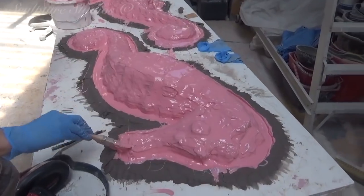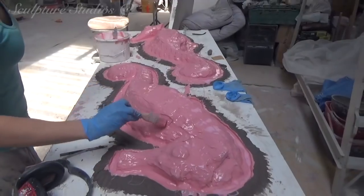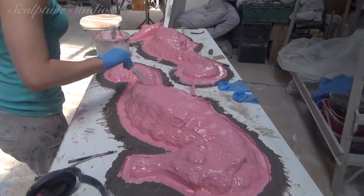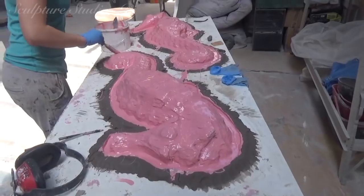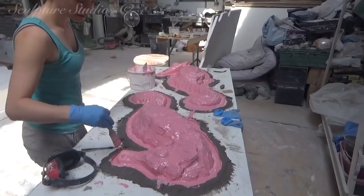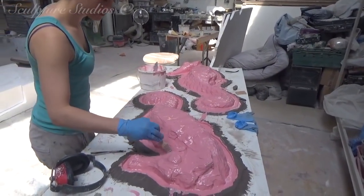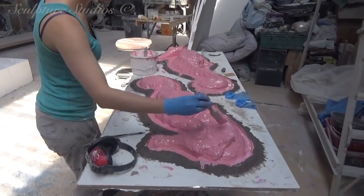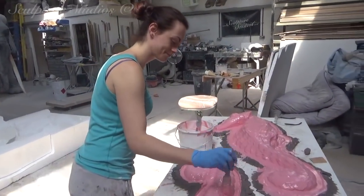Often when we create a two-piece mould like this, we just put a divide line around the entire perimeter of the shape, all in one piece, and create a mould on either side. As Jess said, as it doesn't need to go together, we're using a flat bit of plasboard here, and that'll give us a nice flat back to each mould. This has been waxed so that the mould can just pop off, and there'll be a nice flat surface on the other side. Then once the two casts come out, we can simply join them and make up the seam line, and because we know it's on a dead flat background, they should fit nice and perfectly together.